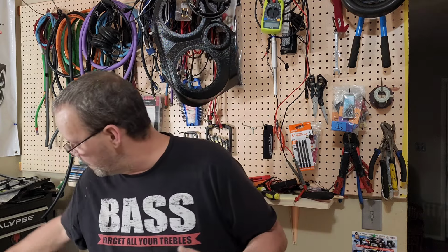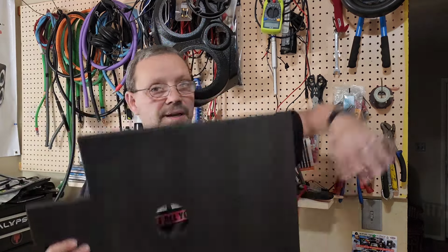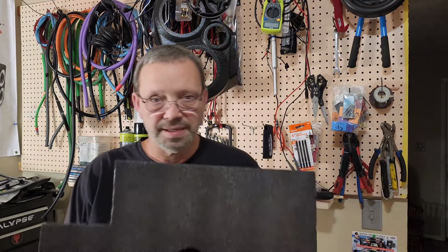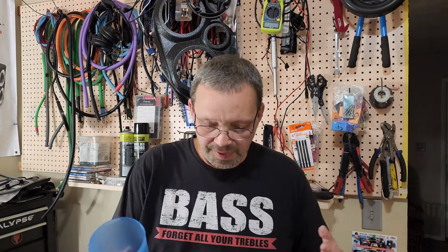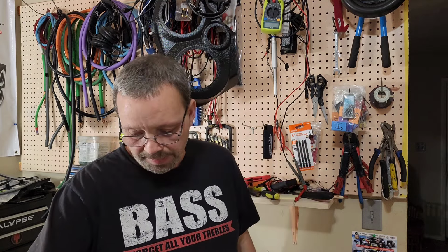In order to take a baffle that would go on infinitely in all directions, you've got to eventually make it come back around on itself. When you do that, the amount of volume inside there is going to dictate how much pressure of a spring you're creating. So you have to put a driver in that is designed specifically for that amount of air volume before it can achieve a point where its QTC is, I hope I got that right, its QTC, I believe, is around 0.707.